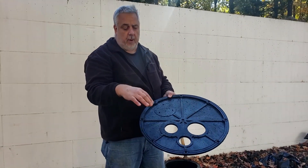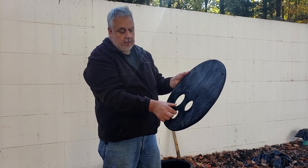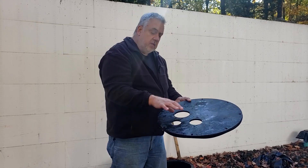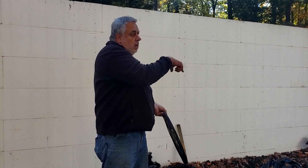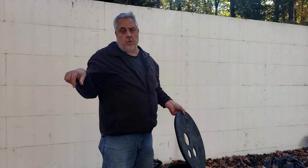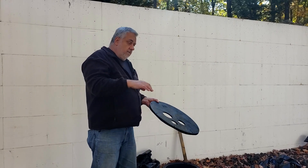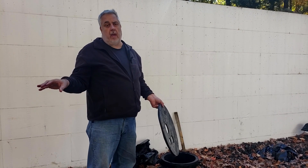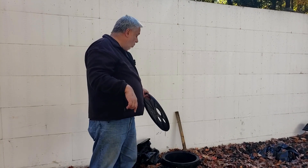The lid has holes for the pipes that will eject out, and those will have gaskets to make it airtight. Why would you want a sump pump airtight? We have a perforated pipe that traces around the foundation system to get the water in there, and if water can get in there, then any radon or soil gas exposed to that pipe can also make its way in.